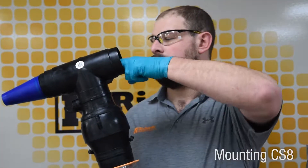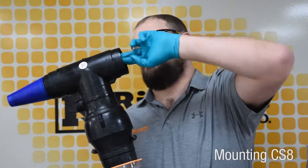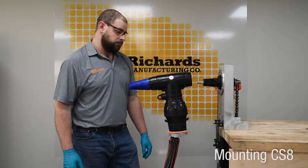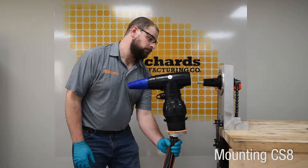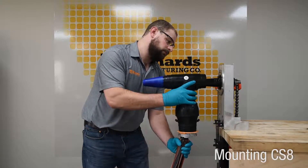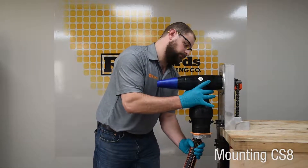Inspecting through the dead brake interface of the CS8, visually confirm the lug is fully seated within the housing. Grip the power cable directly below the CS8. Placing one hand on the body, lift together into alignment and seat the body onto the mating part.